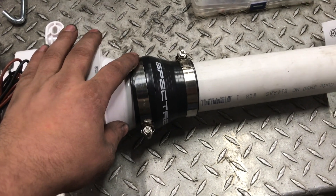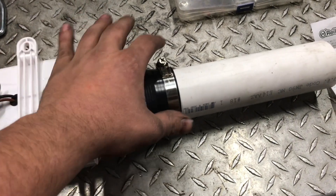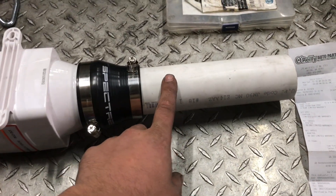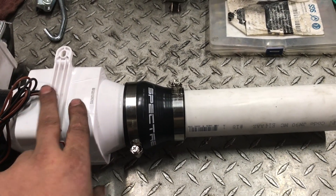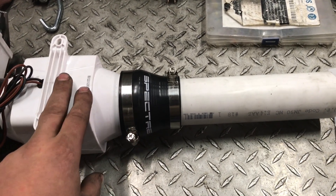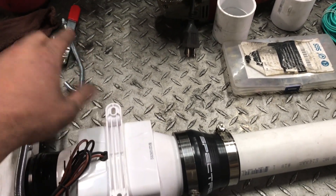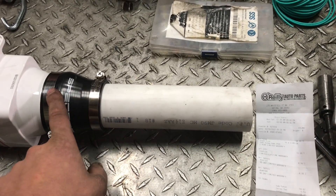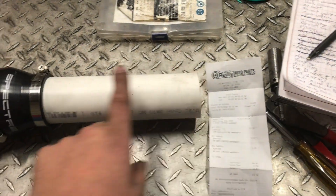They're between about $11 and $20 depending on where you get them. This is a 3-inch OD to 2-½-inch OD adapter — the same ones I used on my Toyota that go from the gas line on the mixer box to the throttle body. They just happen to be the same size for these bilge blowers, and they're cheap enough and seal really well. This will get mounted underneath the bed as this assembly, with the control cable going up to the control handle in the cab. This adapts our 3-inch blower down to a 2-inch ID PVC pipe.